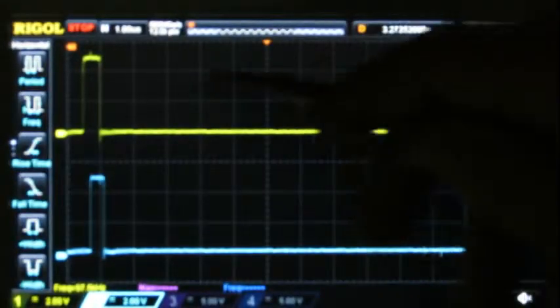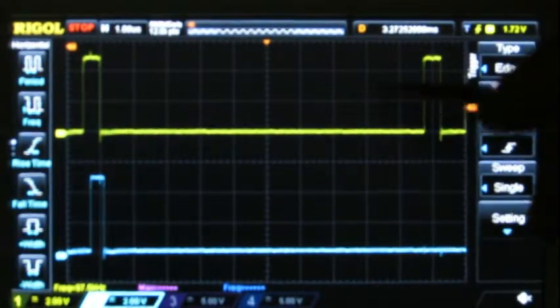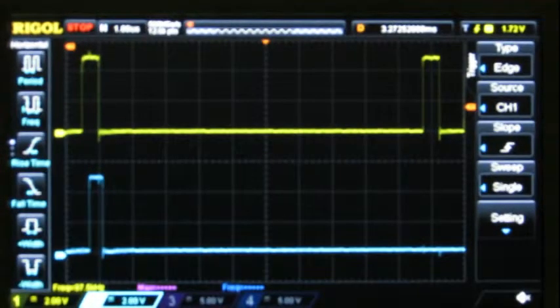I've got 1, 2, 3, 4, 5, 6, 7, 8, 9. Is that right? 1, 2, 3, 4, 5, 6, 7, 8, 9.8 microseconds to the next cycle. The LEDs are still behaving fine. That step from 11 microseconds, that's the resolution that I can step down to.